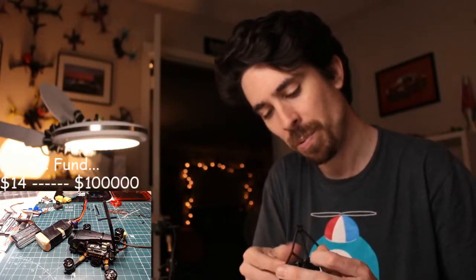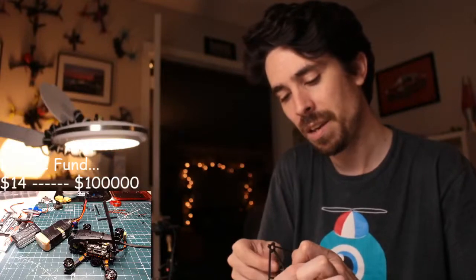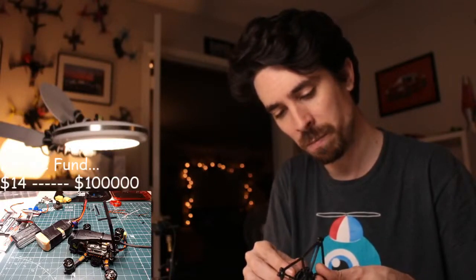because the problem is it's not a curve. The thrust linear is not functioning as it should at low values. It only becomes a curve up at higher values, but at higher values, like 80 and plus, it's kind of unflyable. So I'm waiting on that thrust linear thing, because the quad that I put that on went from flying great to just being a confused mess.